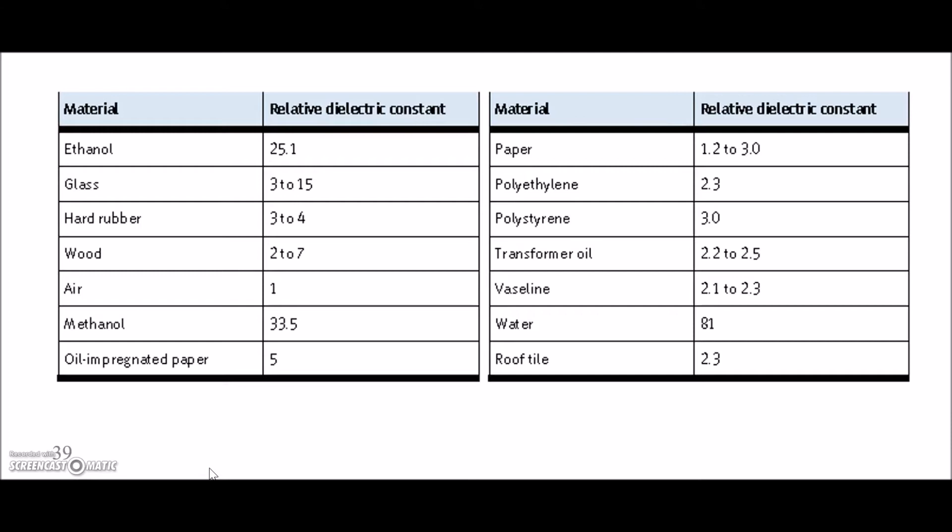There are a number of questions to answer at the back of the lab. To finish off, the reference for the capacitive sensor is air, which has a dielectric of one. Wood has a dielectric value very close to air, so it's hard to see. Paper was very low as well. Metals have a high dielectric value and are easily seen. In our next lab we'll look at different thicknesses of materials and liquid/water level sensing — water has a high dielectric value and will be detected at a greater distance. That ends lab number seven, thanks very much.